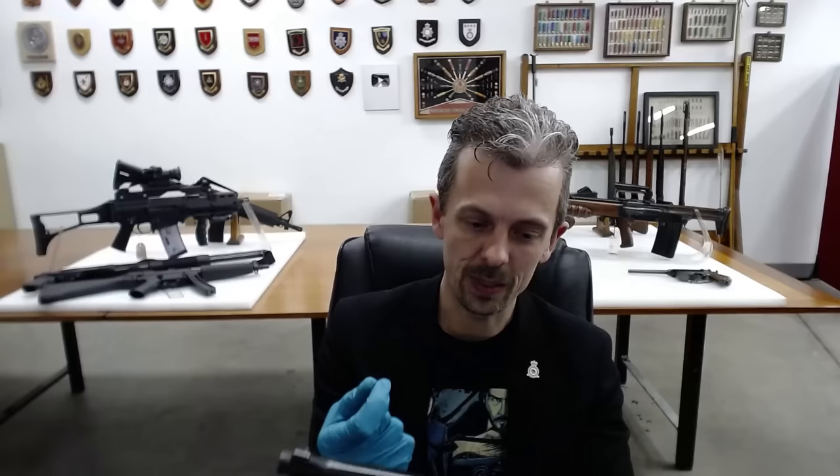So this is a 1960s concept for a very cheap, lightweight rocket gun. Very simple design with a forward hammer that drops to the rear, strikes the round on the nose to initiate the rocket motor inside, and then the rocket accelerates back over the hammer to re-cock it and out the barrel.